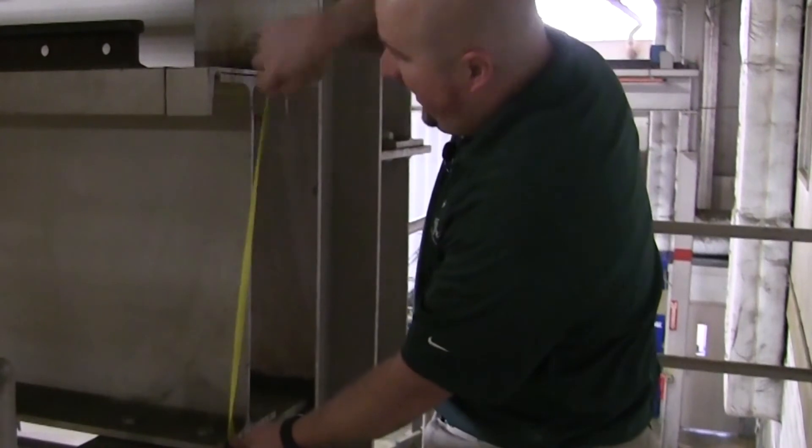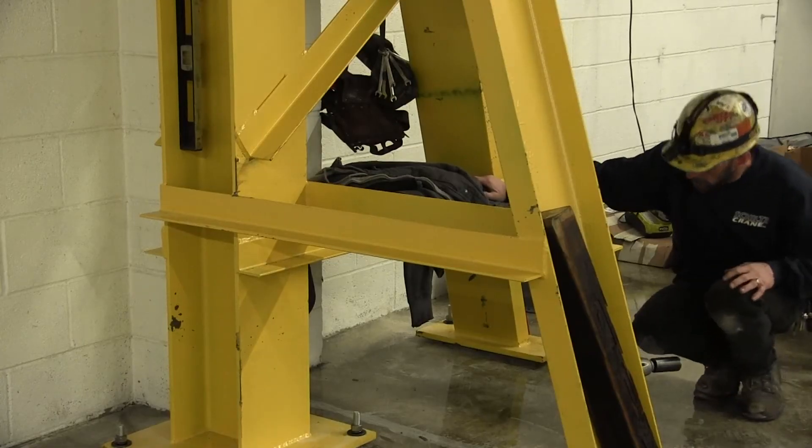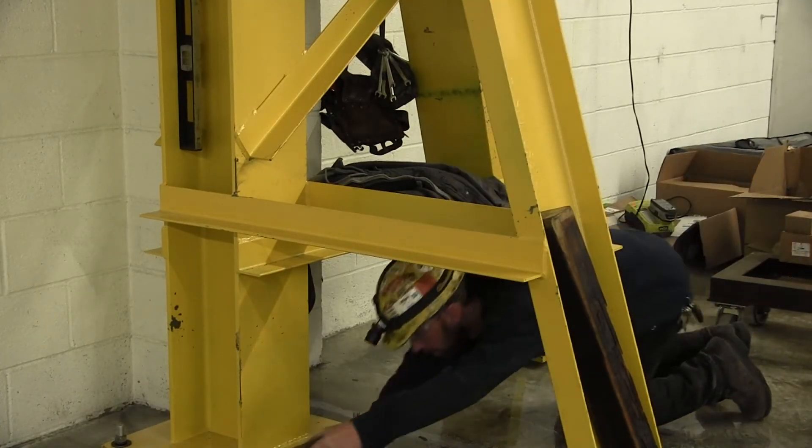If you're buying an overhead crane and already have a facility, you'll save quite a bit of money. But depending on the age of your structure, there are considerations before you put an overhead crane into it. We'll take measurements of the existing runway to run numbers behind the scenes and make sure it can support the crane, and also take measurements of any equipment in the area to consider when designing and quoting. If it can't support the weight, we have the ability to drop an intermediate column in between each support to support the runway on closer centers. Otherwise, we may have to consider a full new runway system.